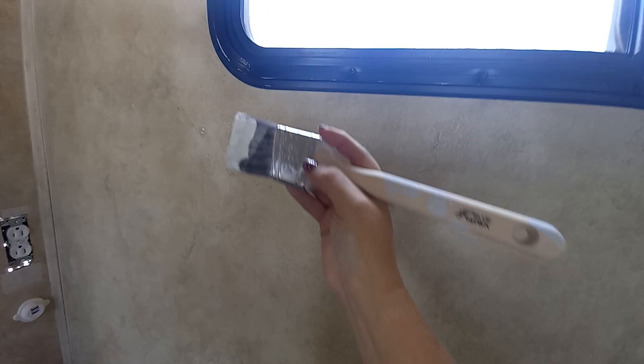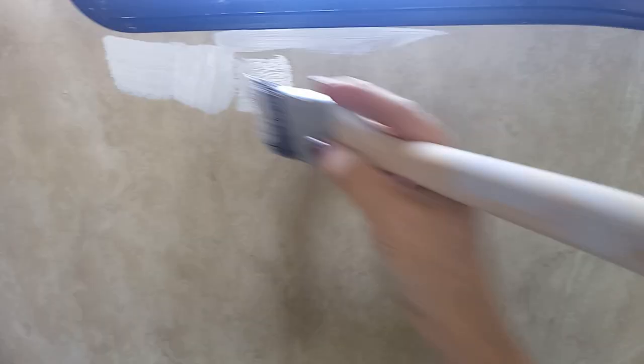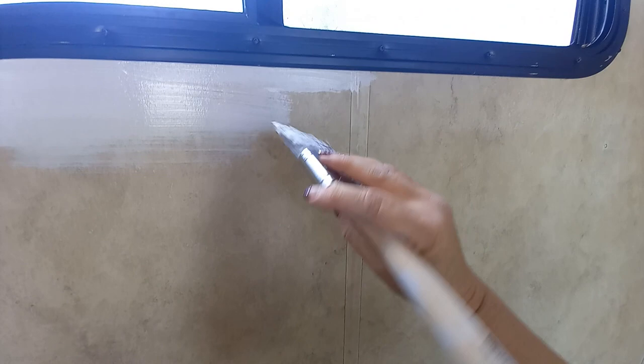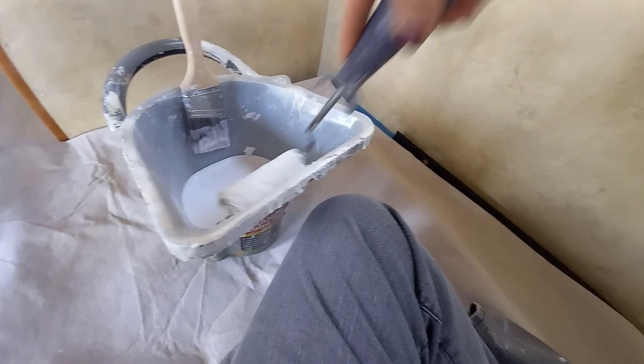Okay, guys, we're going to go ahead and start cutting in. A little tip too — you don't need a ton of paint to cut in. The worst thing you can do is have a big glob. So when you go up close, you're going to want to just take a little bead of paint and pull it along. Then I just follow up with a heavier amount. You do an angled brush and then you just push it in like this so it just hits the surface. Then you can just come along and smooth it all out. That is how I like to do that. Then I will go ahead and get my roller ready.